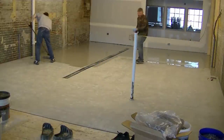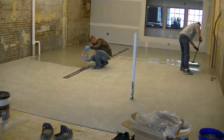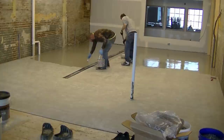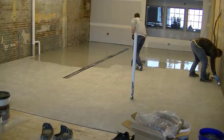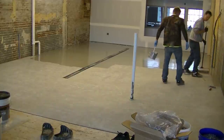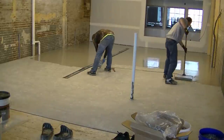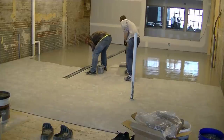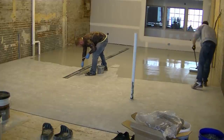It's a two-to-one mix ratio — two parts A, one part B. Mix it together for about a minute or so and then we are ready to roll it on. The key is just getting it on nice and even. You don't want any puddles, you don't want any thin spots. It's pretty easy to do once you get the hang of it using an 18-inch roller like that. You can see I'm going over it twice just to make sure it's all evened out. This floor has about an inch and a half slope to that trench drain, and the coating is not going to run — it's not thick enough to run to the drain.